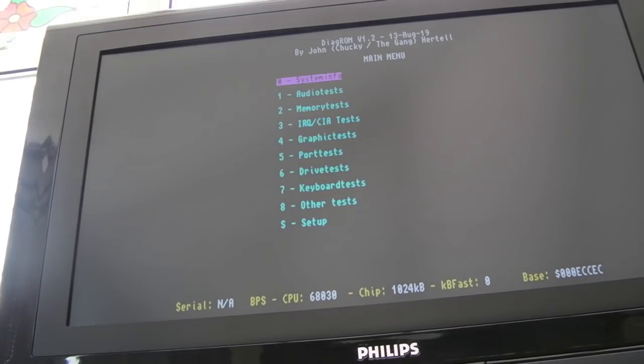The amount of messing around I have done looking at clocks and everything around there. I could have sworn the CPU wasn't booting. I'm pretty sure it wasn't actually. So it was that, I'll show you on the diagram, that DS-ACK signal. Even though those GALs there look primarily just for the IDE, they're on the IDE page, it was just looking back at them to double check them, and I saw that DS-ACK signal and I had a sinking feeling, thinking, I wonder if that's why it's now not booting.